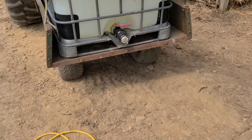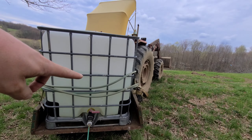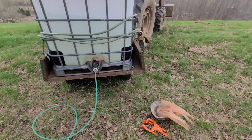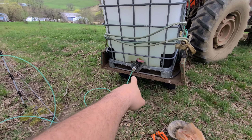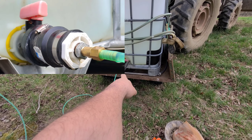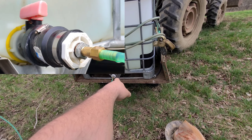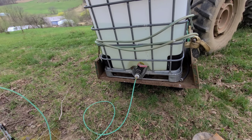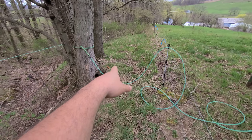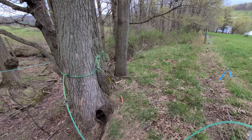The tank's about full. Just pumped up the tires. Now to get it up on the hill. Got the water jug on top of the hill here. Had to make a second trip for the stuff that you conveniently forget at the bottom of the hill. Got it hooked up — got a 5/16ths barb on a 3/4, 1-inch reducer, and then into the plastic fitting. Comes out 5/16ths into the line. And we should be good to go. Let's open the valve and see what happens.